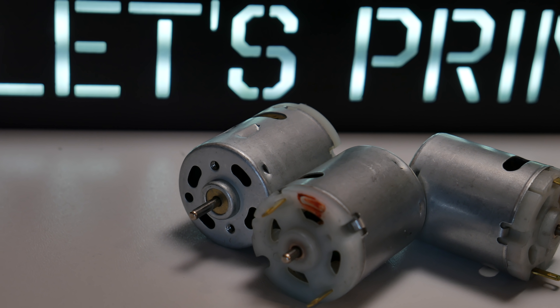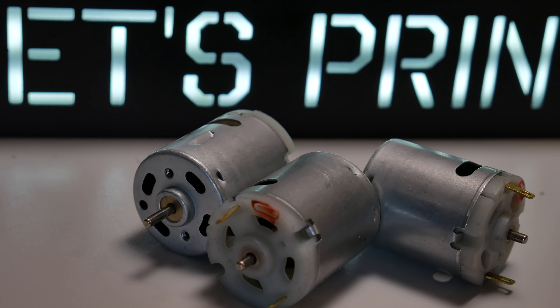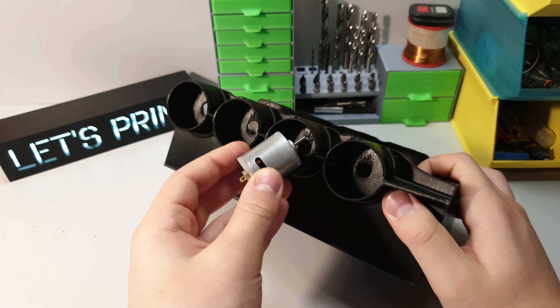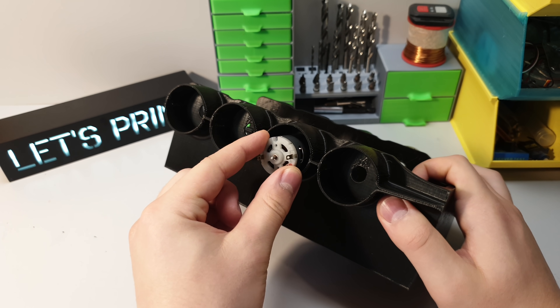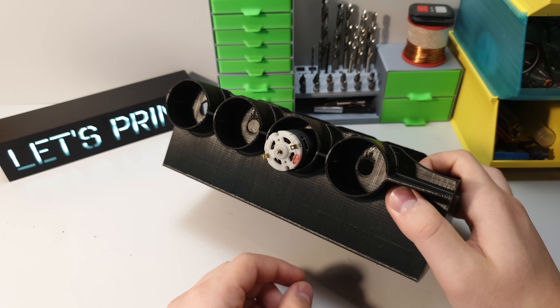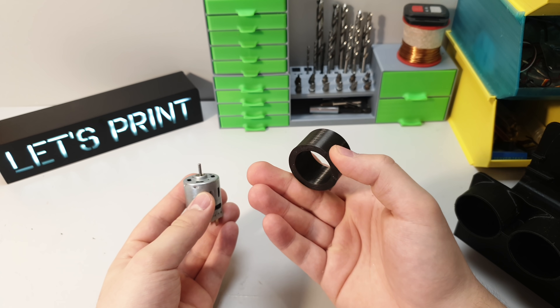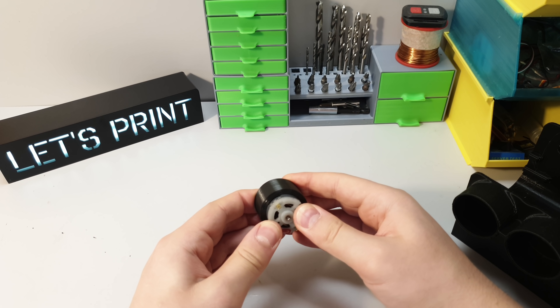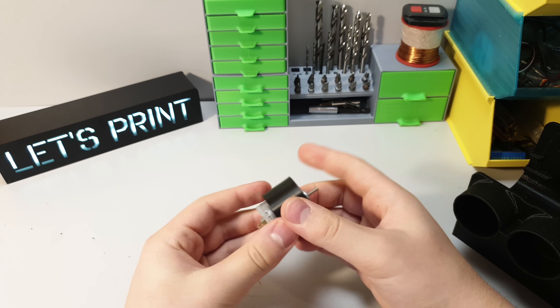If you are planning to do this yourself, you also need 8 electric motors. The ones I am using are 12 volts and 27.5mm diameter. But I did have a design flaw here, which was not working because I had to start thinking again. So I designed one spacer where the motors fit in really tightly, and the spacer I can glue to the main body.